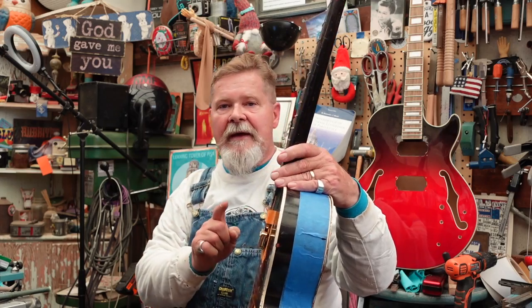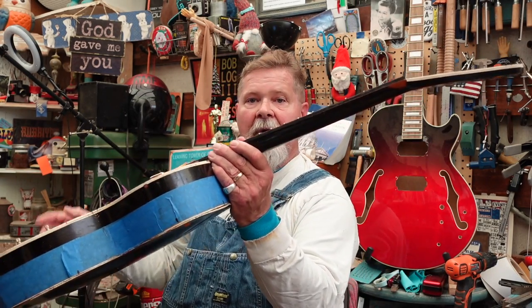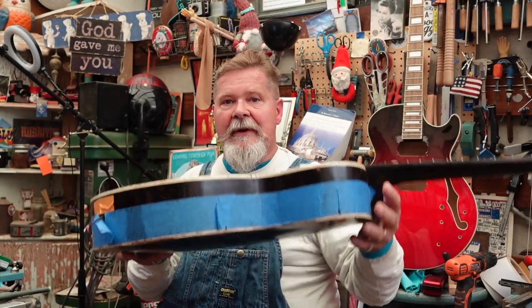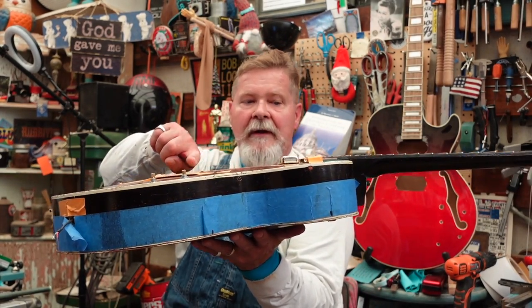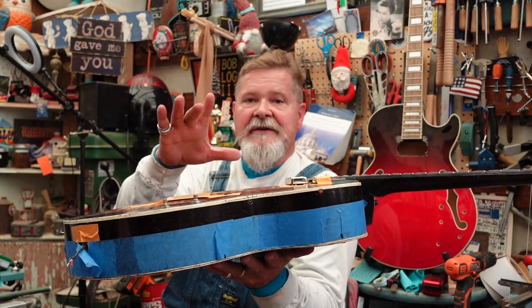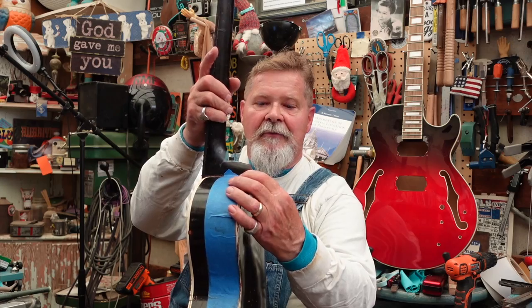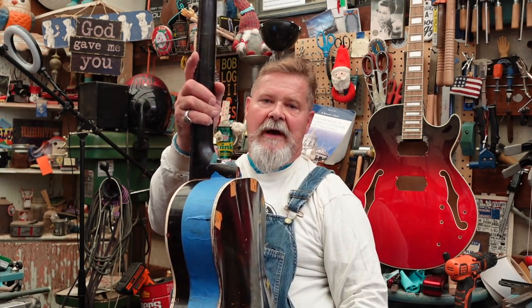So I'm going to take a piece of straight edge that's metal. I'm going to lay it across here. I'm going to clamp it here, like Ellie Mae clamp it, that kind of clamp it. And I'm going to put the bridge here so the straight edge hits the top of the bridge. I'm going to secure that, and when that happens, this neck will rotate down just a little bit, and then I will mark this, and then we will finally glue this up.